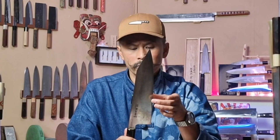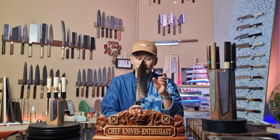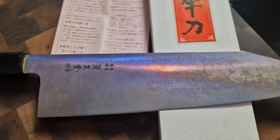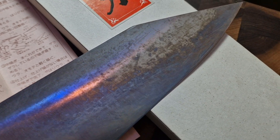With a semi-clad blade you have two layers of cladding steel that protect the carbon core steel, so you only have to worry about the exposed carbon steel at the edge. But this white mono steel carbon blade is reactive all over the blade, as you can clearly see. I knew this SK mono steel blade was going to look great as soon as it developed a patina, and it definitely looks great. I think this SK steel is a very basic carbon steel, generally used on cheaper knives and not tempered to a very high hardness — it is an excellent steel however.